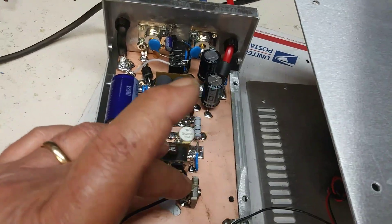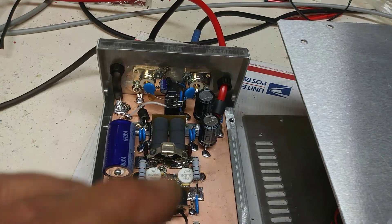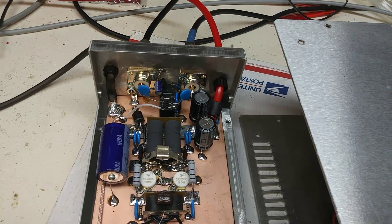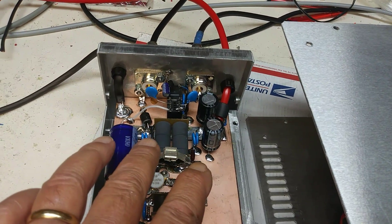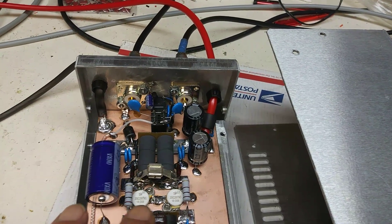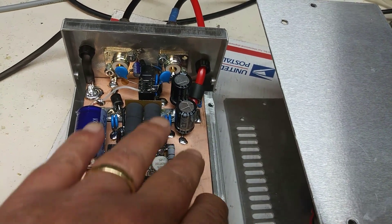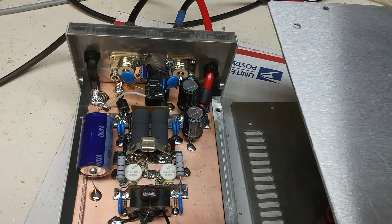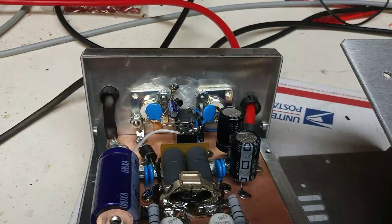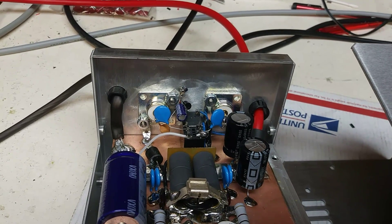I just left the trimmer pot in here — did not put a fixed value in there, just left this in as it was in the other one. I utilized the two holes that were already drilled in the heat sink. When I went to put the three-pill board on it and mount it up, the heat sink was too far over for it to sit on top, which is fine — not a problem at all. They did grind the back of it where the SO239's go, and I replaced the two SO239's.